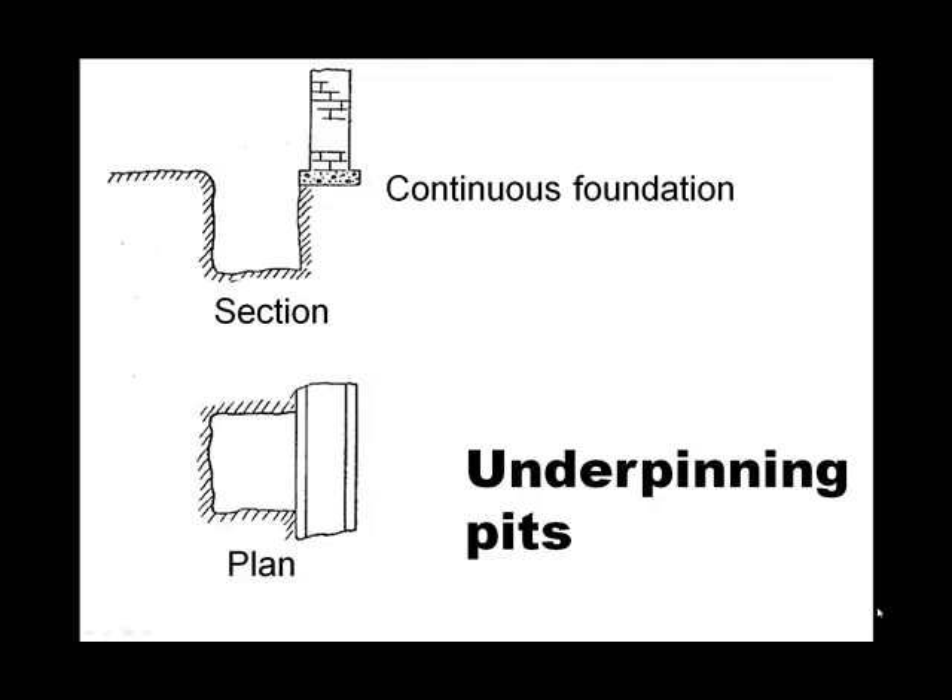When you've gotten that advanced as far as you want to go, you're ready to now excavate under that continuous foundation. The foundation has to be competent to span even that limited distance, be it four or five feet — it needs to be able to span that. If you are underpinning a concrete structure, it will certainly span that. But the condition of the soil is another consideration. It's very hard to lay down any hard rules when it comes to underpinning.